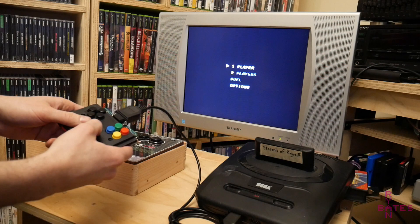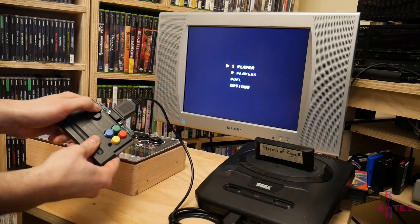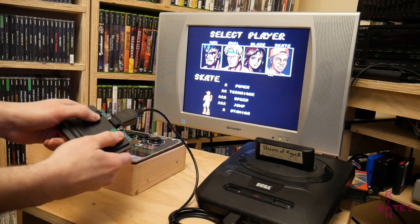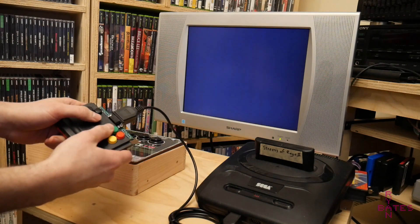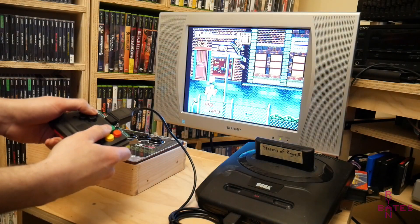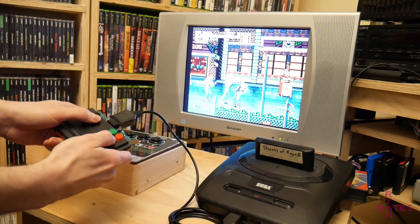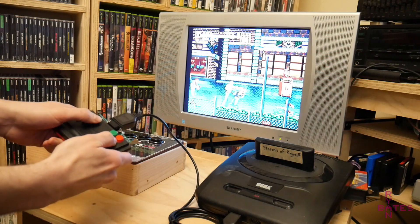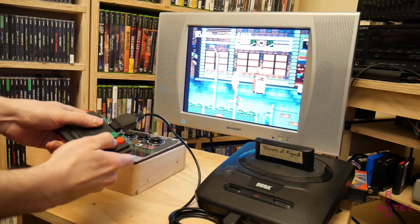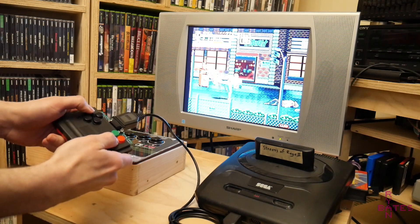So this project is done. Though it's not the original scope, it did come back from the dead with some improvements. You can apply these techniques to build your own NES or Super NES controllers — probing point to point for continuity and retracing all the connections until you reverse engineer what's connected to what. Both of those Nintendo controllers revolve around a simple IC that you can still find today, even if it's new old stock. Building one from scratch is within reach, and that's if you don't want to sacrifice an existing controller for your arcade project. The whole point is to preserve the limited supply of OEM equipment that's out there and make something new.